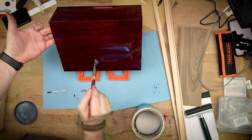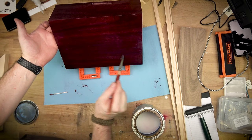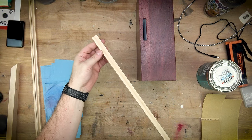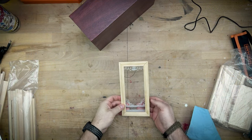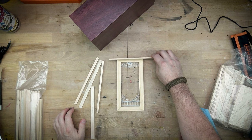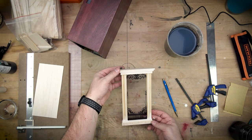The reality is this is not going to get a lot of wear and tear — it's going to be sitting in a bookcase and the case sides are really not visible. For the front you need a little bit of trim molding, so I just used some pine that I routed out and built into a little frame. I also wanted to spruce it up with stuff that looked architectural like the Haunted Mansion in New Orleans Square, so I found a wrought iron grill work design and got that 3D printed. Then I built up some cornice molding using balsa wood to give it a little more architectural reference.